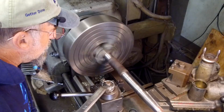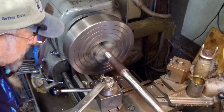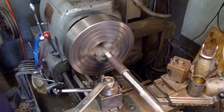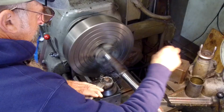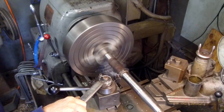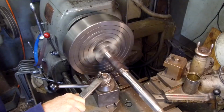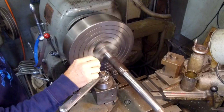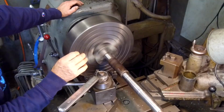All right, we're touching there. We'll take 50 thousandths. Usually I'm a little bit heavier at the start of my weld than the end of my weld, because I come down and set the puddle and then I come across. When I come up, I reset the puddle and come back down. That way we keep the buildup even all the way across.